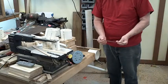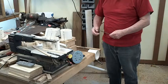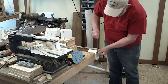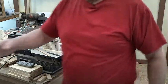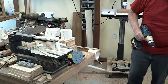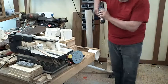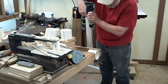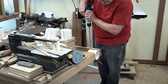I happen to have a very long drill. It's a 1/4 or 7/16 inch drill, and it's very long, fits nicely in my drill driver. I can use this to drill through this side and all the way down through the bottom on the opposite side, and I can drill 2 holes at a time using that method. So I put this long drill in my drill driver, tighten down the chuck, and now I can drill holes all the way through like this. You can still drill your holes one at a time if you like, just by following these marks.